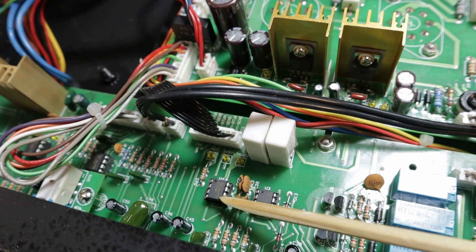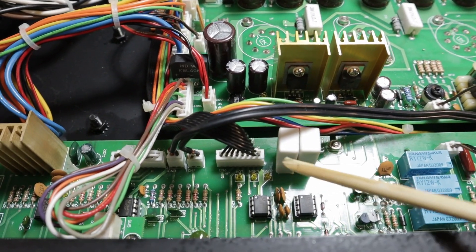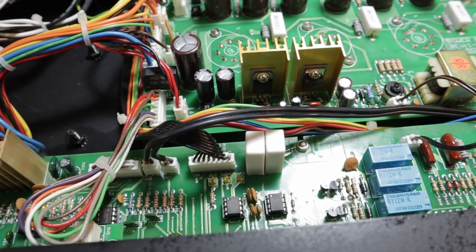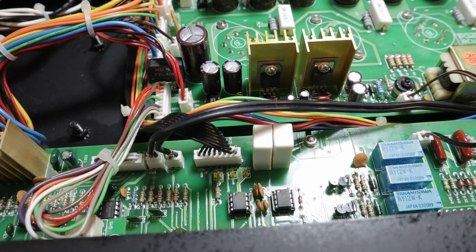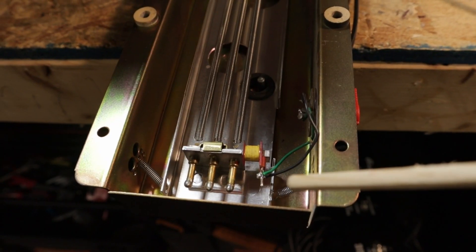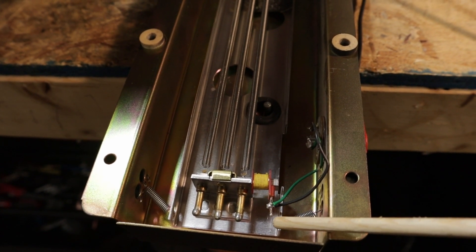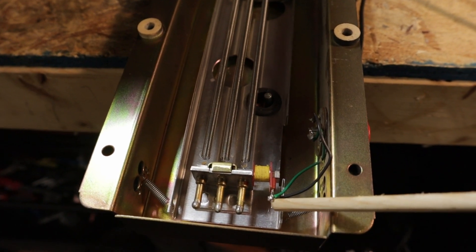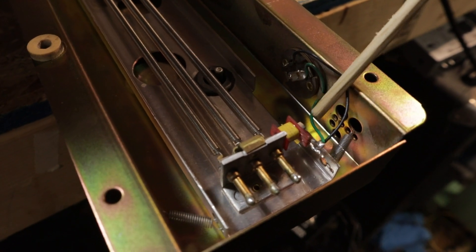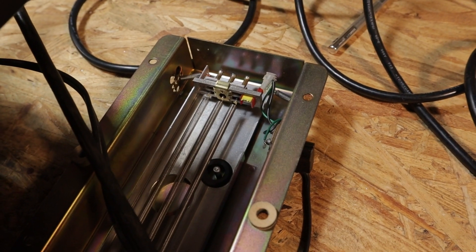I swapped this chip out for a minute because I was trying to figure out what was wrong with the reverb. When I would bang on the springs and it would still make noise, that told me the return cable was good. So I flipped the cables and reversed them on the tank. The cables still worked, so we know it wasn't a problem there and it wasn't a problem with that chip. So I went back to the reverb tank itself and started manipulating this quick connect that was here and I got the reverb to come back on. So the quick connect was bad — easy enough fix. It's got these two nice prongs on the transducer here so I just went ahead and hardwired those in. The one on the other side seemed to be okay, so that one is still in.